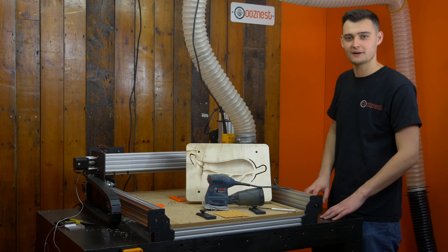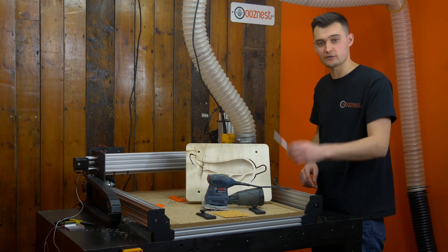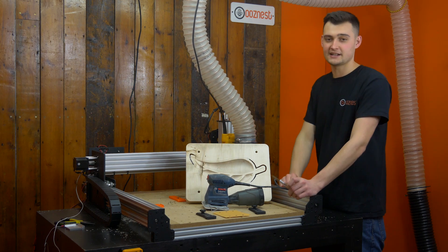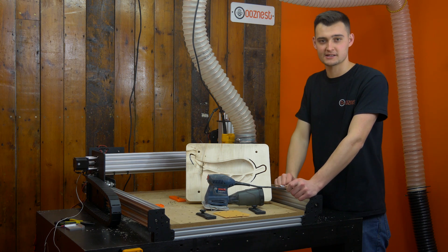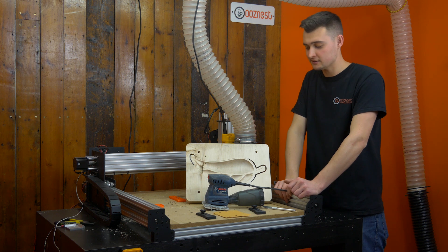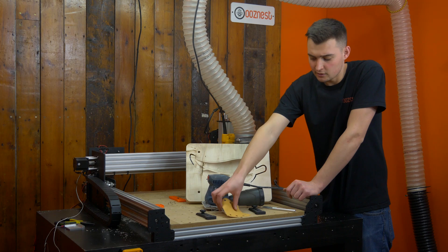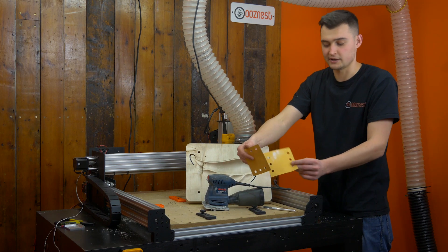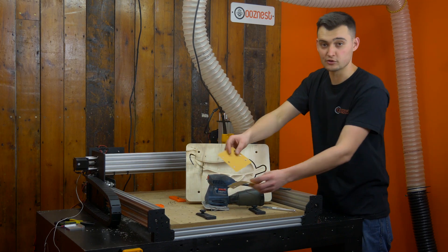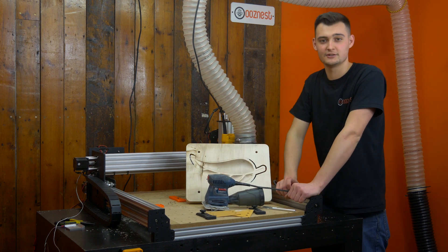Now that all of our 3D finishing toolpaths are complete, I've left enough material just around this edge here so I can remove it with a scalpel. This saves adding any tabs, which will be a bit messier to clean up. I'm then going to tidy up the surface finish using an orbital sander with 240 grit and 120 grit, just to remove any rough marks or torn marks that we may have left on our project. We can then add some finish and the project will be complete.